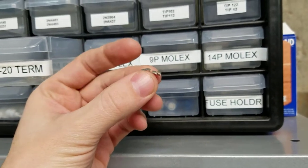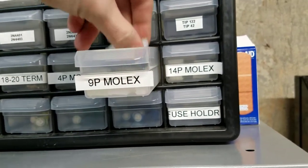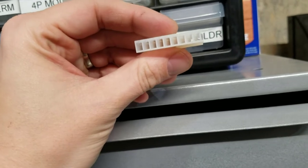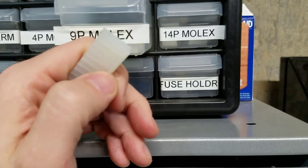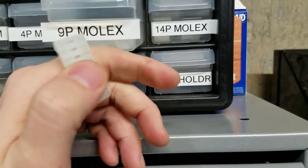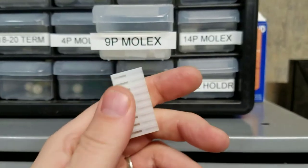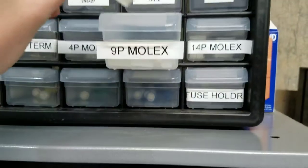Terminal pins are what you actually connect to the wire and fit into the actual connector. A connector looks something like this — these are different from IDC (insulation displacement) connectors that came on many machines. These are Molex connectors that use terminal pins to make a much tighter connection. You'll see a lot of people recommend these across different sites — this is all I use. I don't use IDC connectors; I just don't feel like they last.